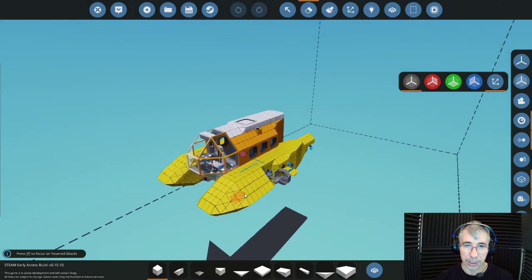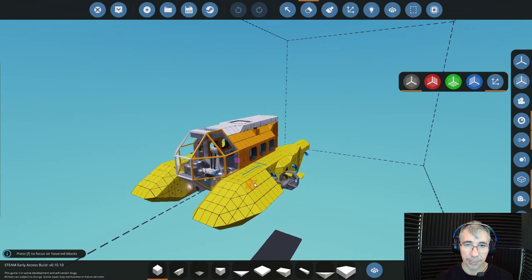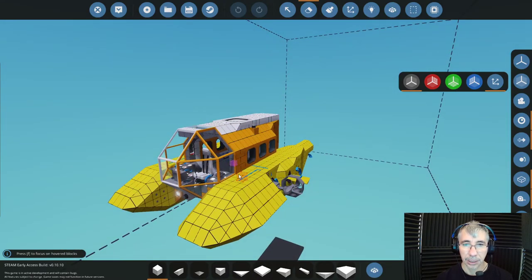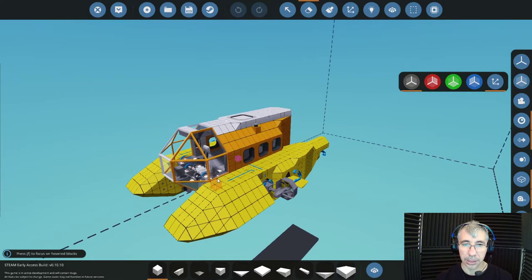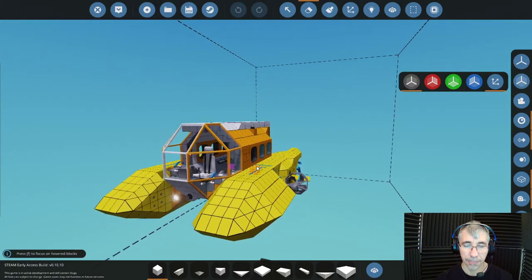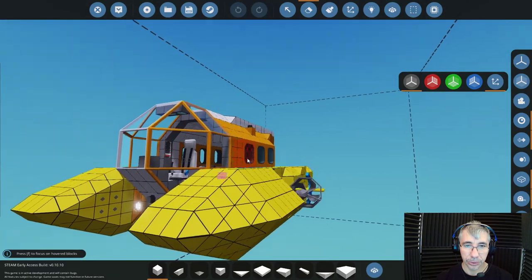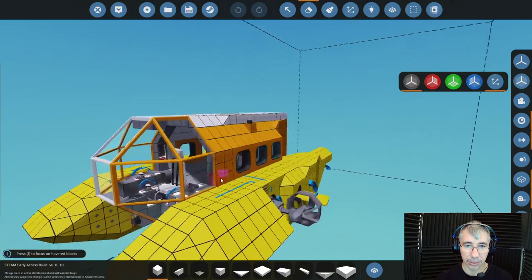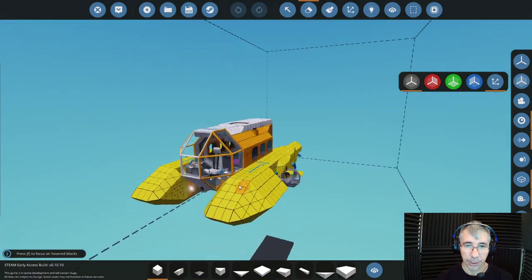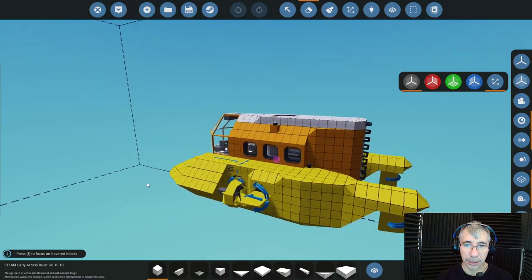So in this case, the size of the tanks is important because it determines how much water is being displaced, but at the same time there is the weight. If you want something to float, the weight of the water displaced has to be at least the same as the weight of the body you're putting in water. So the tanks displace water, but they shouldn't add much weight to the vehicle. And this is why these parts here are hollow, right? Because then they reduce the weight. So you have to play with that, and it's hard